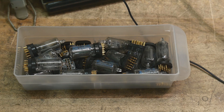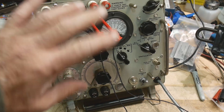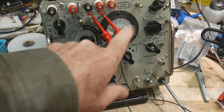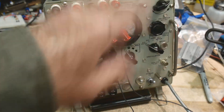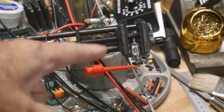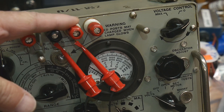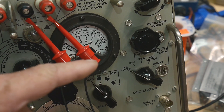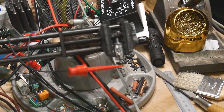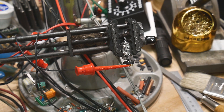I'm going to light one up using this high voltage power supply. It can output up to 500 volts with a variable adjust and a meter, so I can adjust it to any voltage I want. It's for capacitor testing, but it's low current — it'll be enough to drive a Nixie. I'll connect to the plus and minus leads with a 1K resistor in series just to limit current in case something funny happened. The Nixies should fire at around 170 volts — that's the minimum firing voltage.